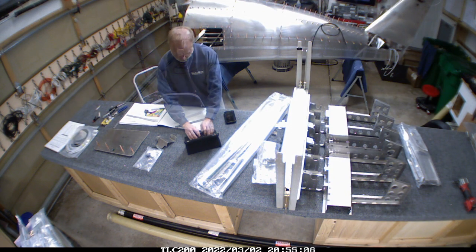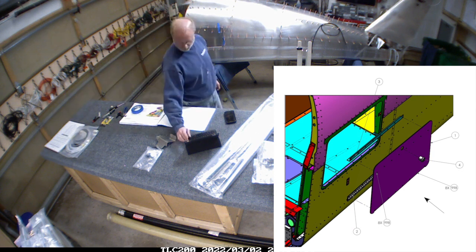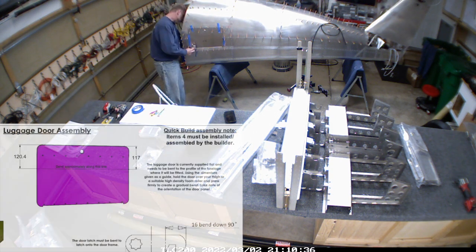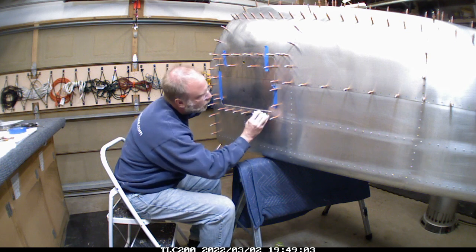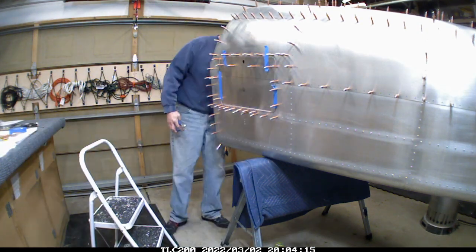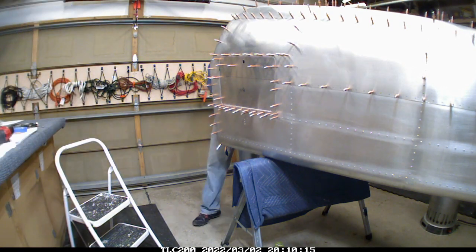I'm just working on getting the luggage door. I kind of was nervous about this part because it's sort of a moving part and needs to line up just perfectly — there's a space it needs to go into to make it perfect. And it actually went together a lot easier than I expected. You just kind of follow the instructions. This particular piece needs a bend right where the line goes through it, and they recommend — it's a pretty thick piece of aluminum — just put it over your knee and bend it at that line. I bent it a little bit, it wasn't quite enough, bent a little more, and then it was just right. It seats in there very nicely.